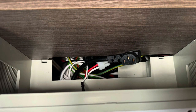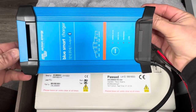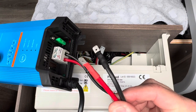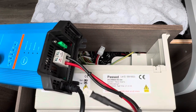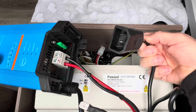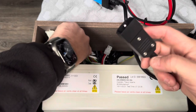Now it's just fitting the charger itself. It looks quite bulky but it is actually quite a good fit within the space where the old power supply came from. You can see the black and red cable there that I've fastened in with the two spade connectors, and these will slot into the plug that was already there. You could chop the old plug off the old power supply and use that if you really wanted to. I didn't want to destroy the old one, and you can see I've added a female version of the kettle plug here. So now it's just a case of plugging this into the caravan side.